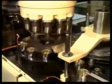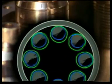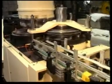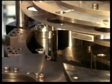In the beading module, stabilization beads are formed in the can body by rolling a driven forming roll inside the can along a stationary external guideway with opposite profile. The beading rollers are supported in the working position, and the beading depth of each roller can be adjusted using the cam. Stable guideways absorb the forces and ensure that the beads are continuously evenly formed to high standards of quality. The beading module is easy to open and like all other modules, is fitted with central height adjustment.